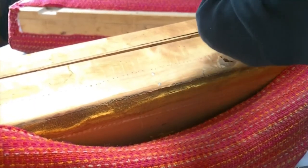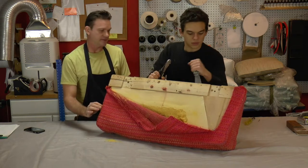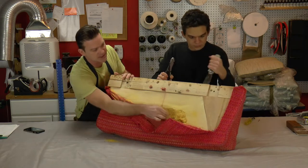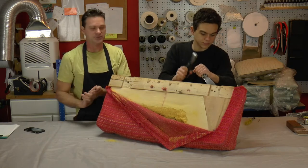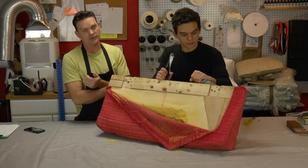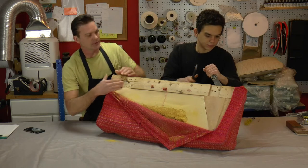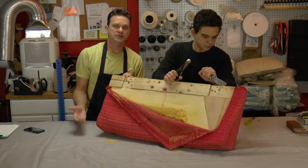There's a thin layer of veneer - maybe an eighth of an inch, probably a sixteenth - that's behind the latex foam. Then this piece of wood sits on top, giving substance in the back for the foam to go against. Without that veneer the foam has nothing to attach to. What we think happened is the person who repaired this, although they did a thorough job, was afraid to take off the fabric and just replace the wood - that was the actual problem with the sofa.